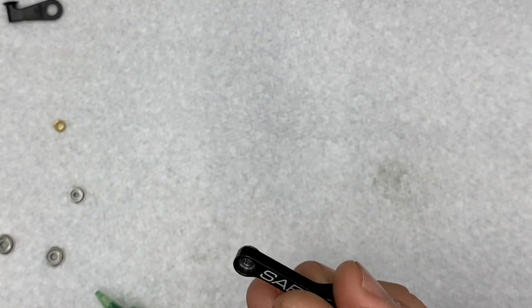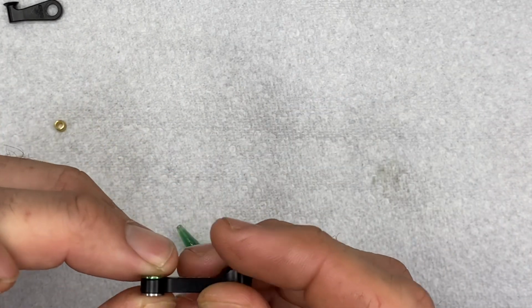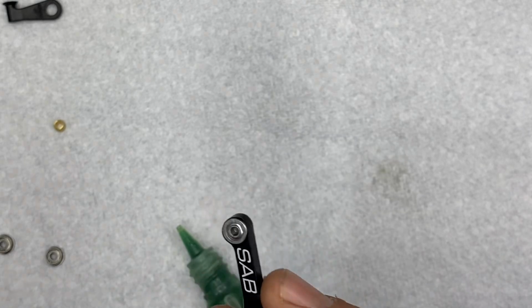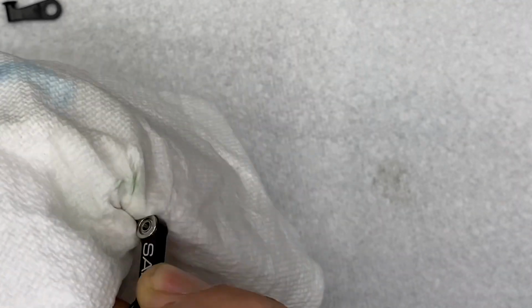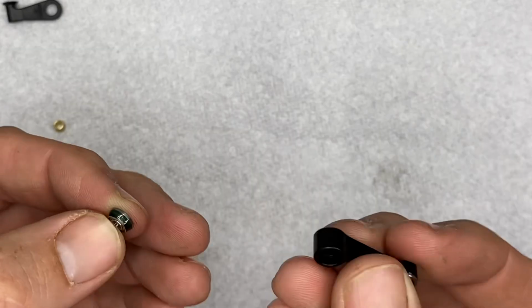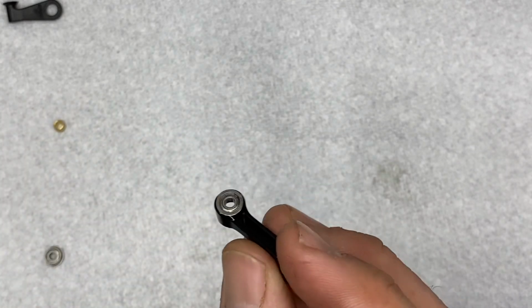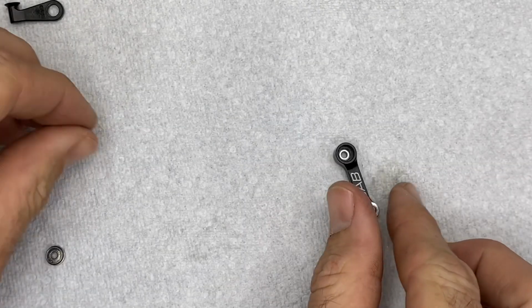And then you're gonna do the same on the front bearing, on the other bearing, retaining compound around the bearing, push it into place, give it a spin so you can help get the retaining compound evenly around it, wipe off the excess, and then the exact same for the back bearings. Retaining compound, put your bearing into place, push it in, wipe off the excess,